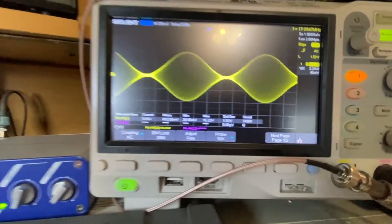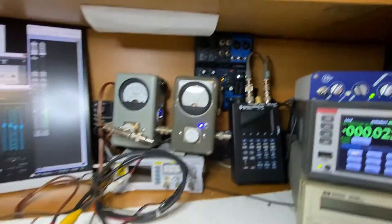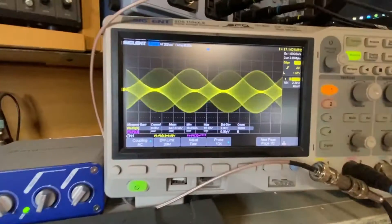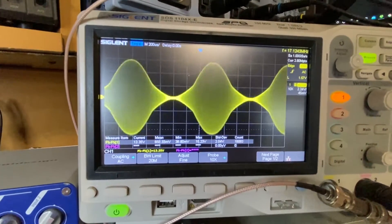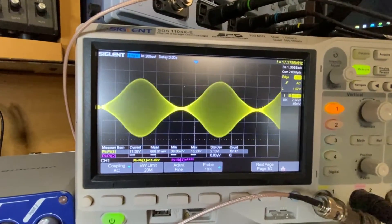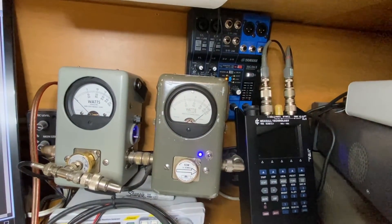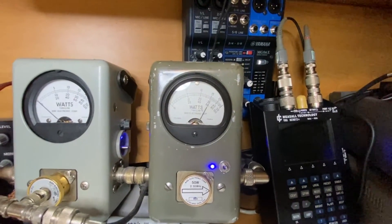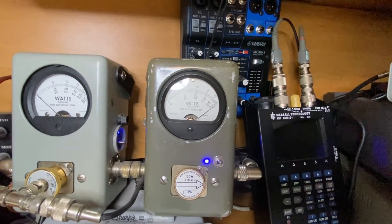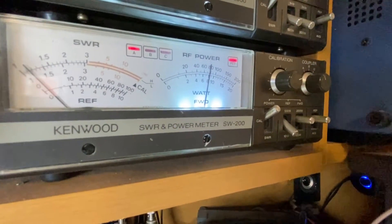As you can see, there we have our 100% modulation. We have some asymmetry and almost 40 watts on the meter as we raise up our asymmetry — we can see 150, 200, 250 percent modulation. As we raise the asymmetry our power also goes up: 100%, 150%, 200%, and then beyond this meter — 250% gives us almost 80 watts of PEP power.